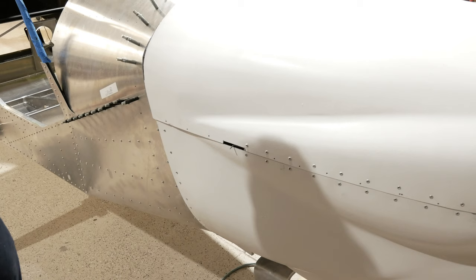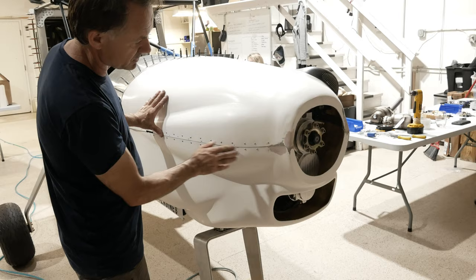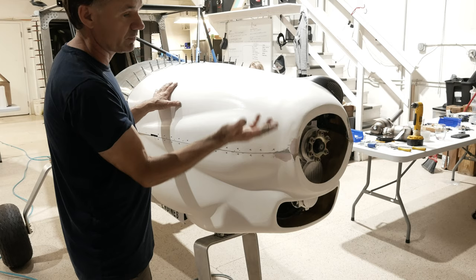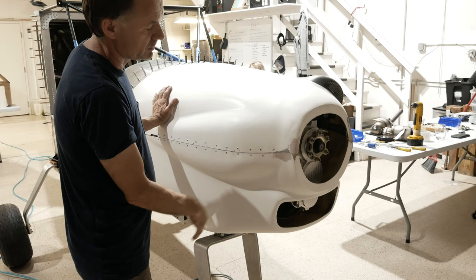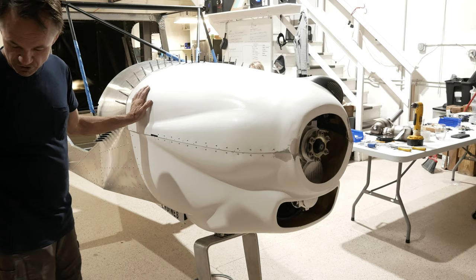If you have areas like in the front here where, after you put your hinge and everything in, it's not perfect, there's nothing, this is an airplane, it's no different than a car. Get some coarse sandpaper and rough it up real good. Take a little Bondo and smear it in there, and before the Bondo hardens, take a rough paper and just knock off the extra Bondo, and that's what you do. That's just how you would do it, just like if you're working on a car.